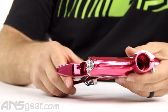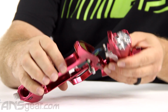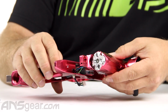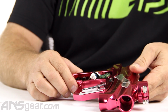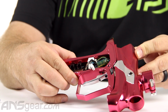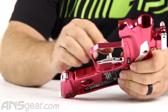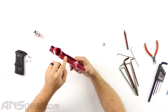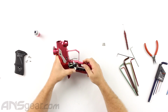With this one, because we have our post back here that needs to go through that O-ring inside of there, we do have to put a little bit of pressure to make sure that that post goes through. Otherwise, it'll stay just like this and it'll never go down. So I have to kind of help it a little bit. When my wiring is good, when I just leave it alone, nothing bounces up or moves, so nothing's trying to push back against it.